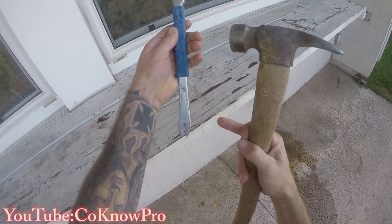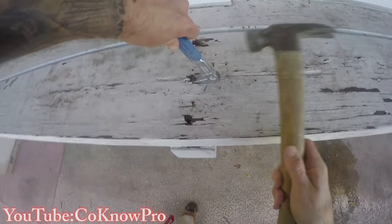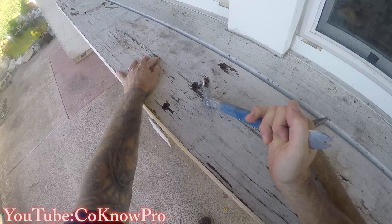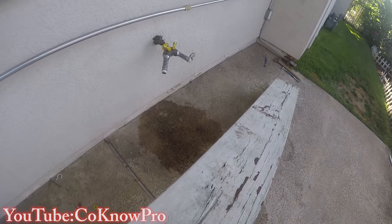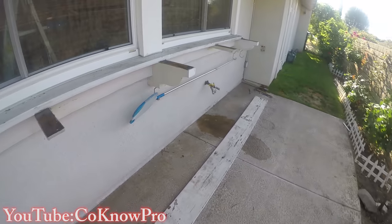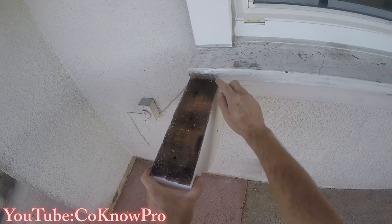This is a cat's paw. What we're going to do with this cat's paw is use it to pry out the nail — you get underneath the head of the nail and then you can pry the nail right up, but you need a cat's paw to do this. Then after you get all the nails safely removed, you pull the board off for measurements.